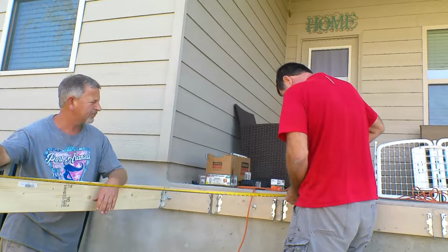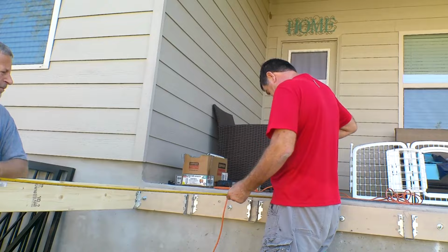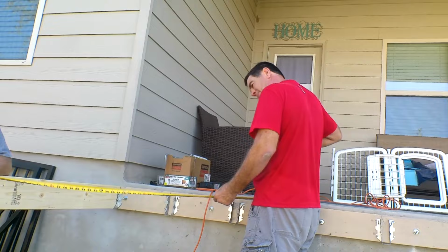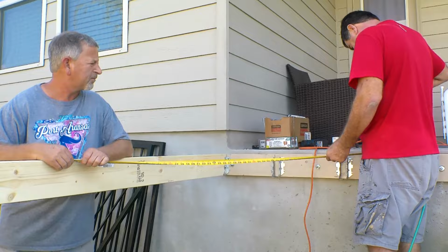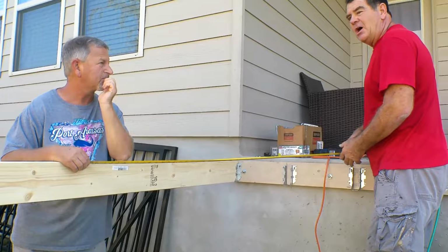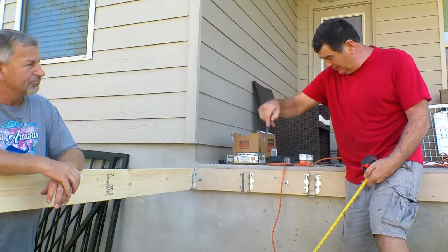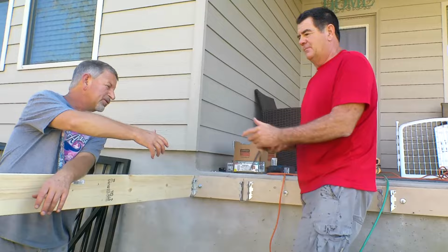Now see this? I'm at 5.5. That means it has to come this way. So hit that and pull it. Hopefully. So, now it reads 5 feet. 3, 4, 3, 4, and 5. That means now that board is straight. So my course will be straight.